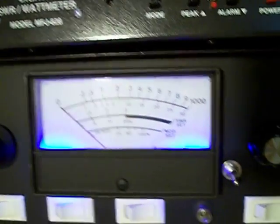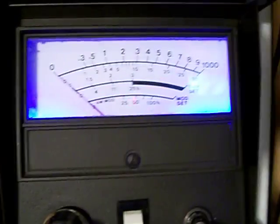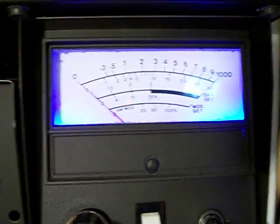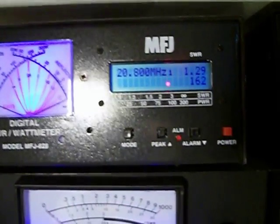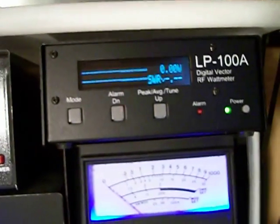Let's take a look at the meters. I'm using a Bird-type sampler — that analog meter measures carrier power. This other meter has a Bird PEP kit built inside it and strictly reads audio PEP. Bird is good test equipment. Then I also have digital meters, and that meter right there I'm using strictly for carrier to monitor the AM carrier, while this one monitors the audio.